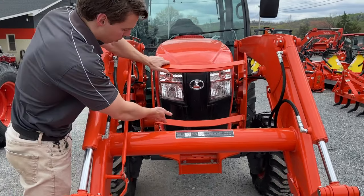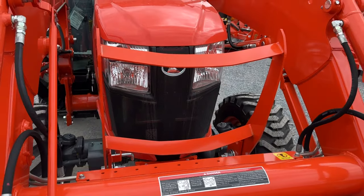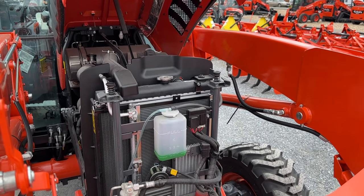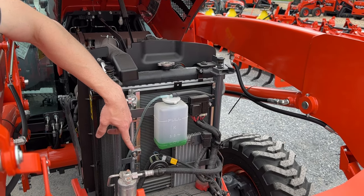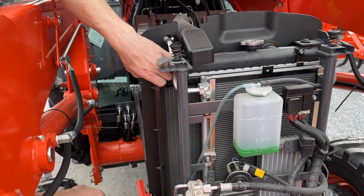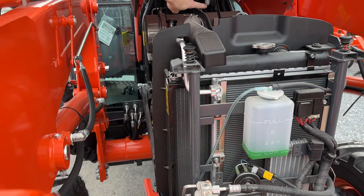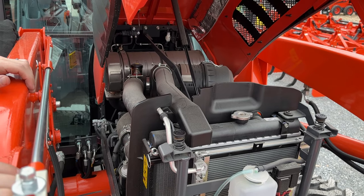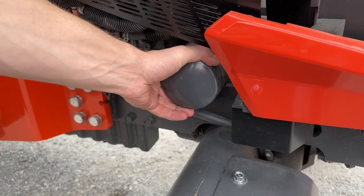To open the hood, pull the pin here, lean the guard forward, pull the ring to unlock the hood, and a little pressure and it lifts itself up. Inside, keep your coolant at the full level. You have easy battery access for jumping, plus extra fuses. Check your radiator screen — pull it out and brush it off if you're overheating, that's the first thing to check. You have a large air filter in the back — blow it out with an air nozzle; you only have to change it every 200–400 hours.